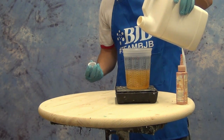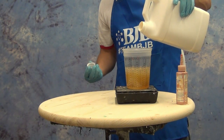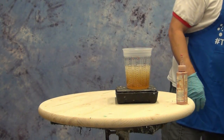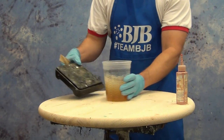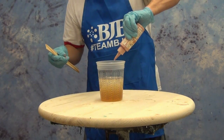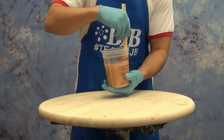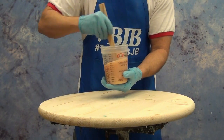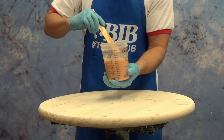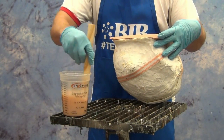Casting self-skinning foam by itself can sometimes result in voids on the surface, especially on really large pieces like heads and shoulders. The way around that is to mix up a skin material like FP15 — very simple, a one-to-one mix ratio by weight. We add a little flesh tone pigment to it, and since it's a very fast-setting formula, we can brush or slosh it into the mold to give ourselves a skin. The FP15 — the '15' stands for its Shore A value — is a fairly soft urethane rubber, giving us a nice pliable soft skin.